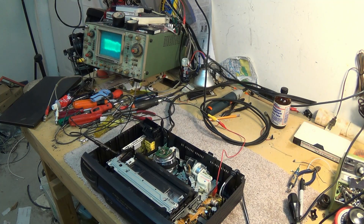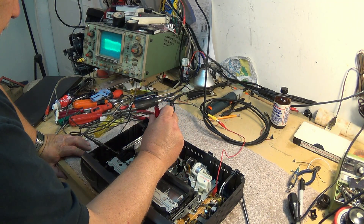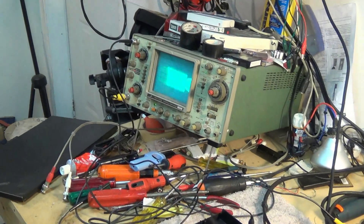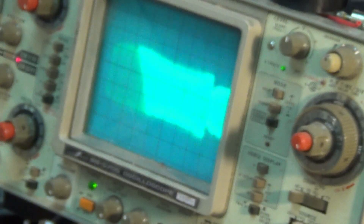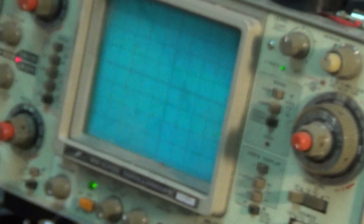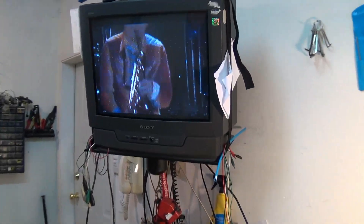After I aligned it, so this is actually probably pretty close. I'm just bringing the level down a bit here on the leading edge and we'll take it back up. So you can see the leading edge here — this is the entrance side guide, and we're just trying to bring that flat, which we have. The exit side guide is relatively flat. And so that's it and it's playing.